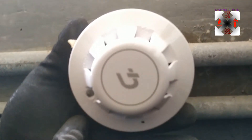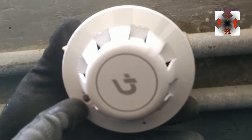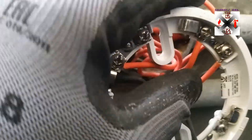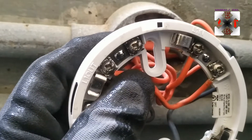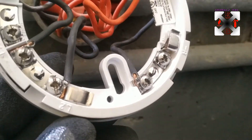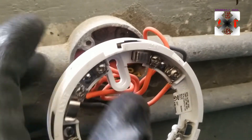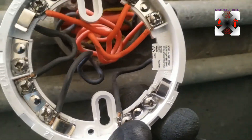It's working nicely — the LED here shows it's working. Let me make a quick recap: the in cable comes here into the loop in. The outgoing cable goes to the loop out, the L1 out. All two cables going in and out come to the L2. Then the remote indicator needs a power supply — we give it to L1, either terminal. I chose to put it here, and the remote indicator minus is kept at R-.